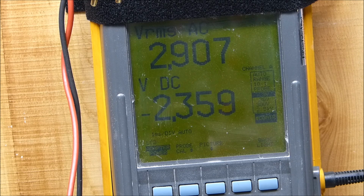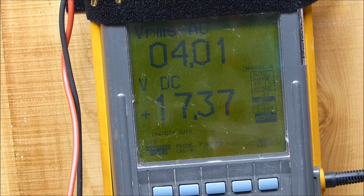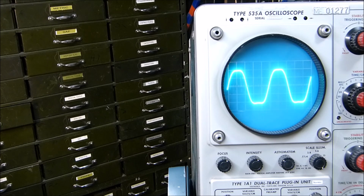It's actually shut off. There's nothing coming out of it. There's nothing coming out of the amplifier. So a pretty hard clipping level is about right there, about 17 volts. Here, let me turn around. I'll show you what it looks like at 17 volts. Hang on. I know that could make some of you guys dizzy. I'm whizzing this thing around, zoom back out here, and then got to film with the camera here. That's what it looks like with 17 volts.